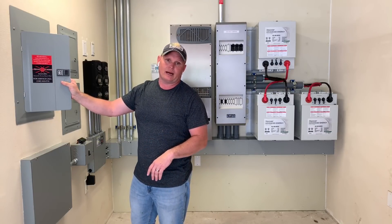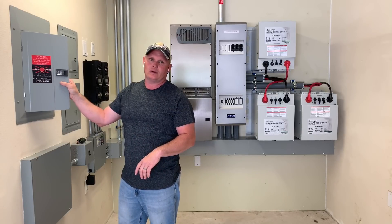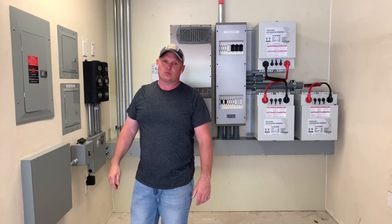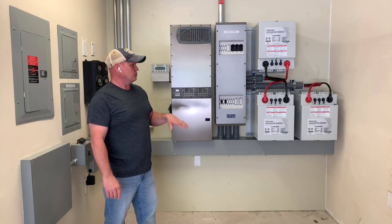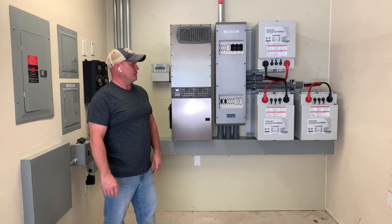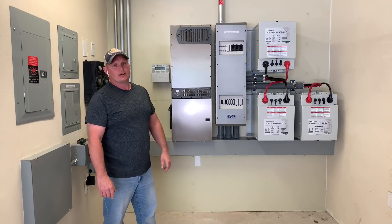This is just a standard AC panel feeding all the standard loads like a normal house. If I did this system now, the only thing I would do differently is add a utility meter — I really like basic metering so that once a month somebody can write down the total kilowatt hour usage and data log it. Remote internet doesn't always work, and a meter keeps everything super accurate. One of the key features of this system was making it so the homeowners didn't have to have a lot of involvement — going for a really safe, really reliable system that I can remote monitor. Thanks for watching — we have one more round to go, just hooking up some comms, and then I'll give you a tour of the arrays up top and show you the rest of the project.